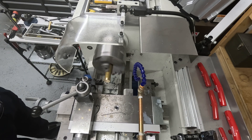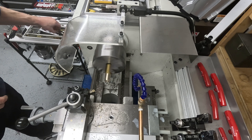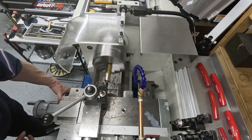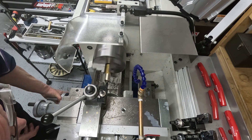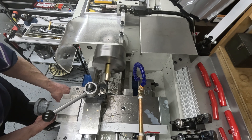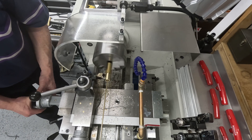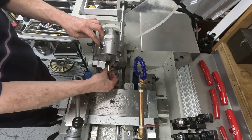This is a quick look at some of the process of making the brass end knob — really it's just turning to an OD, drilling out the bulk of the material, and then boring to a close fit size. There's a little cross hole in this part, which I did off camera, and that's used to lock it onto the actuator shaft using the little actuator lever. Here I'm just parting it off and as usual using a brass rod to catch it.